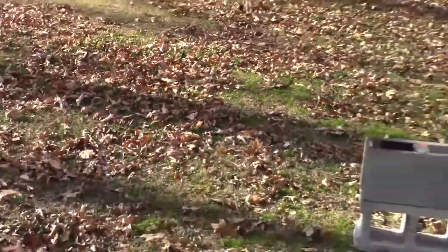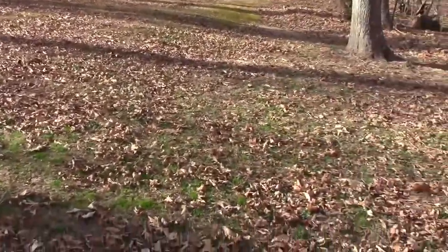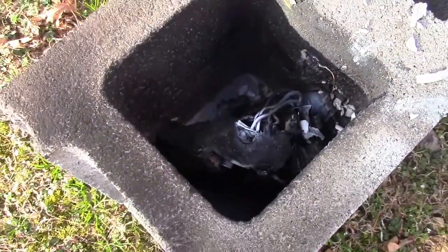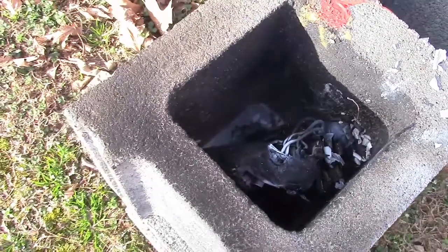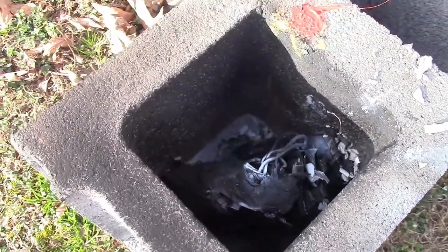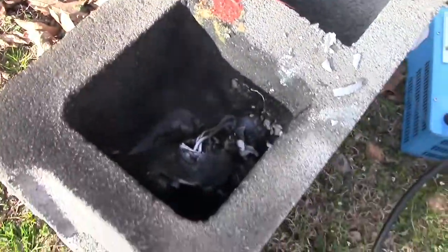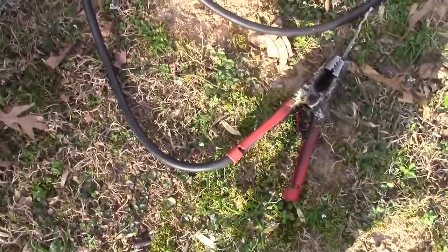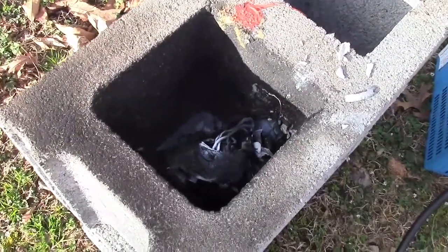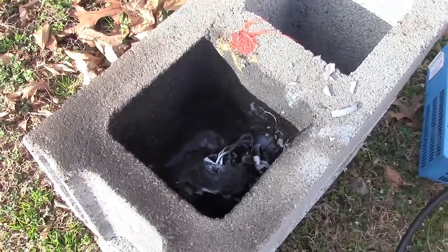Let's take a look at the aftermath. As you can see, there ain't much left of the battery in there. Just that quick high-current load we put on there blew that battery pretty quick. You can see the paint that melted off my alligator clip — it's looking a little sad. But there you go, another LiPo battery put out of its misery, this time by severely over-discharging and over-current.